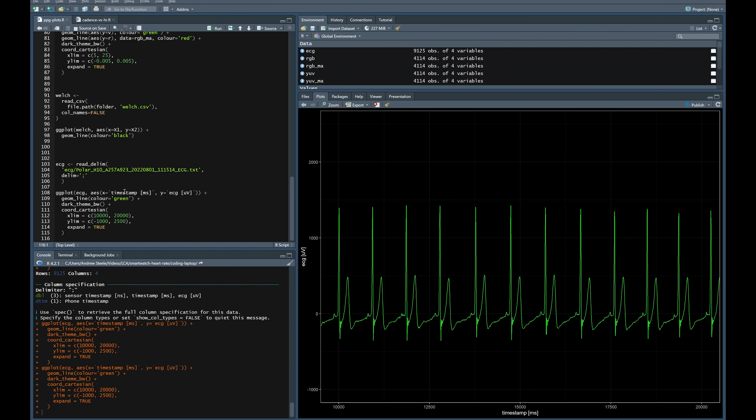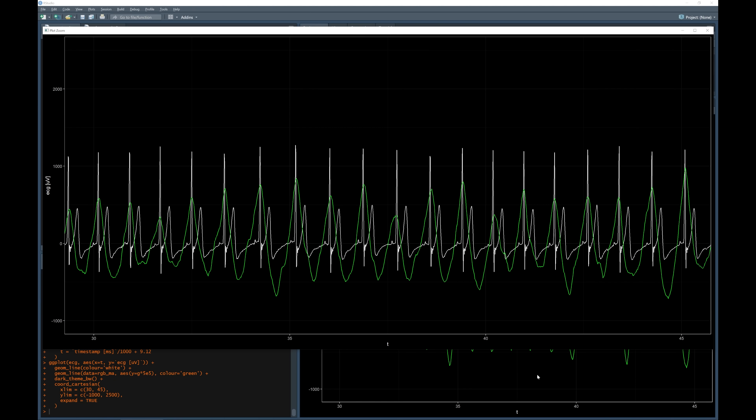The difference is we're using the whole face to work out what the pulse is and then converting that pulse data into a colour overlay so we can see what's going on visually. We also took an ECG using that strap around my chest as an extra test. It has two little contacts on your chest, measuring the voltage from one side of your heart to the other. And when you made me lick them, you weren't just being weird — it's really important for the electrical contact. Absolutely beautiful — it's so clean with these massive big spikes. Then we can overlay this lovely clean ECG trace with that RGB video data. The ECG peaks line up. That's not bad, is it? I reckon we nailed that.